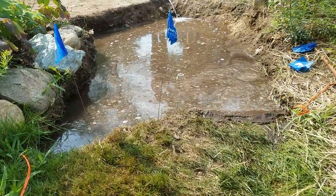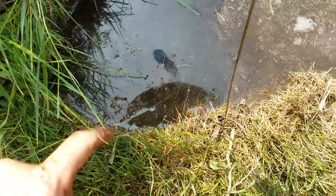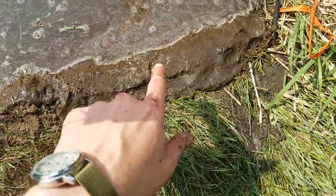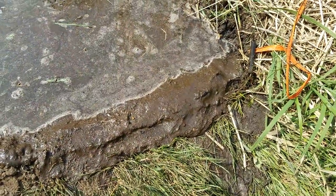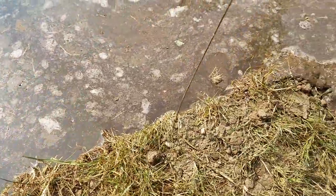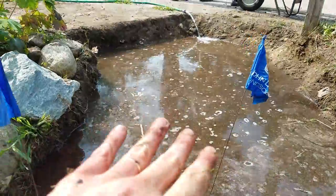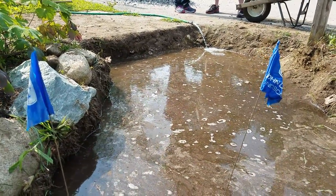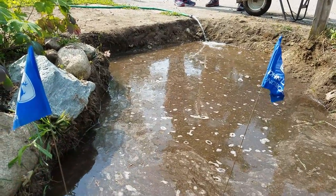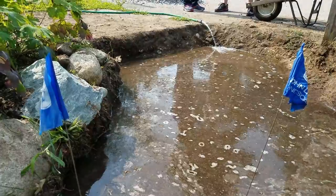Here we are at the new low point — it's getting very close to the edge. This side is a little bit higher in elevation; it's right at pretty much grass level. I built that up just a little bit because it was a hair lower over here, and it's just about to start flowing that way, so we're very close to the overflow point of this feature. The water is being stored in there, and while the water itself isn't moving that quickly, by having a level surface in which all the water can disperse, it's slowing the velocity of water down — so any potential for erosion is mitigated by the fact that everything is level.